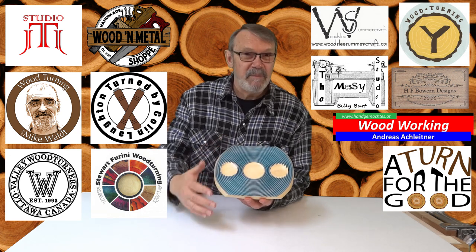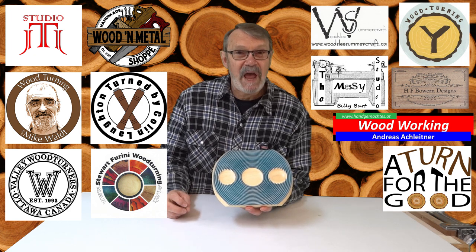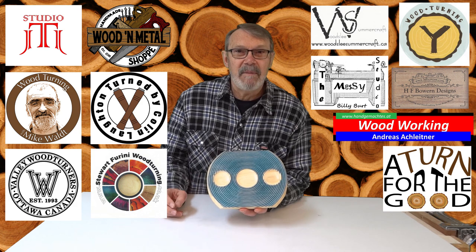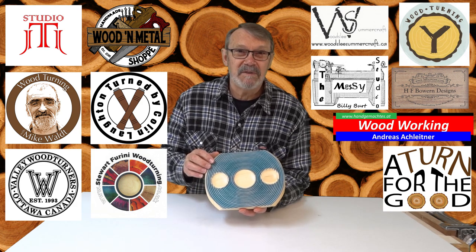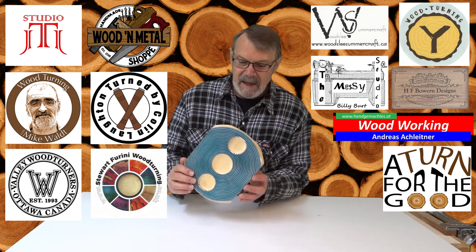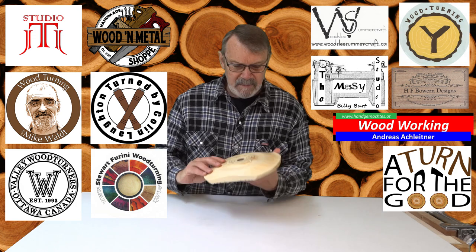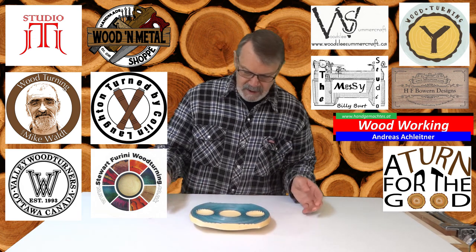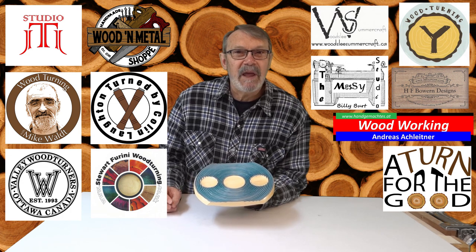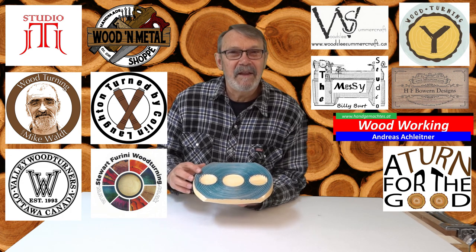I had fun with the beading. I even had fun with some of the offset turning, although it was a real challenge. It was so off balance that even at 500 RPM, my lathe was trying to walk across the floor. So I had to come up with a way of getting around that. And I'm really pleased with how it turned out. Got a little bit of a foot on the bottom, so it looks almost like it's floating there. If you're interested in seeing how I came up with this, please stick around, and let's go take a look at it.